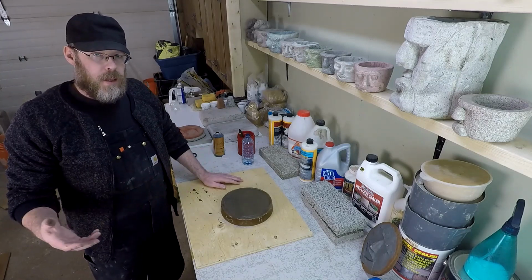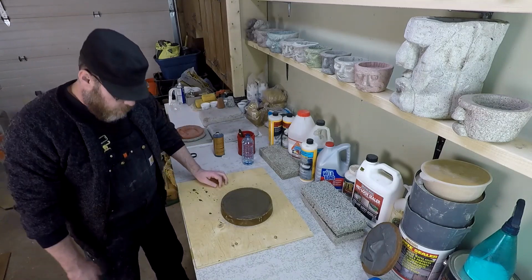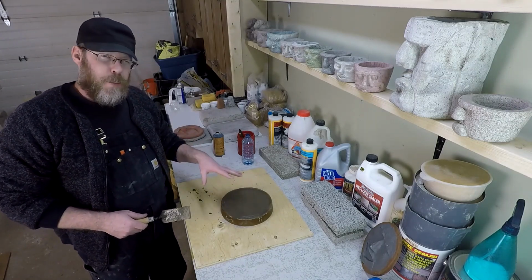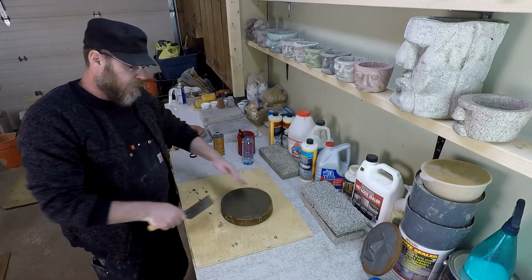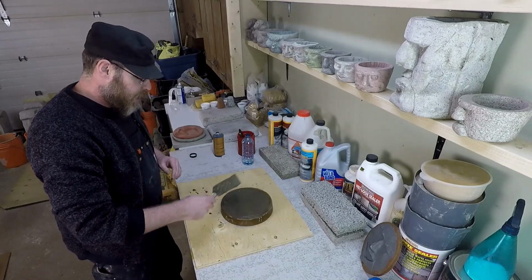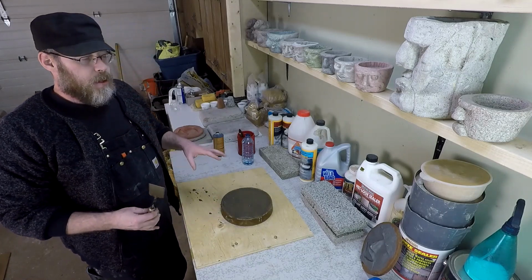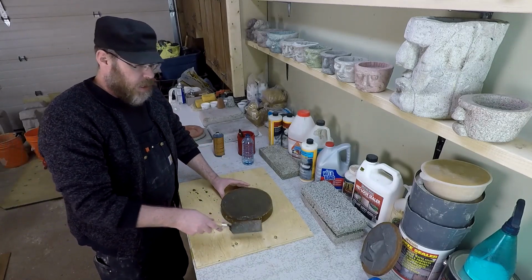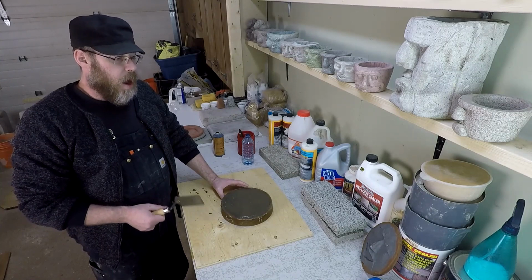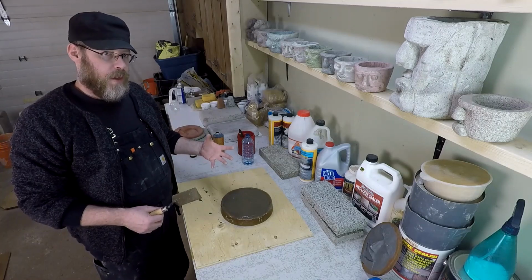First of all, because I'm adding the coloring agent manually, and even just as I mentioned before, the humidity and things like that will affect the finished coloration. Like if I let this set up and right before it's hard, I get in there and I trowel half of it but not the other half, those two halves will have totally different colors. It's very sensitive to the different parameters, and if you're really particular with what you want for your coloring, you need to do a lot of test applications with this before you commit to pouring a new pool deck or something like that, because I really encourage people to not do that if they're particular with coloring. It's just a complicated subject and it's hard to have control over that finished coloring.